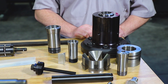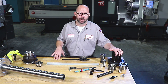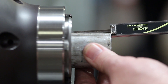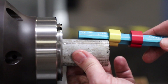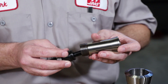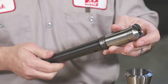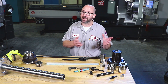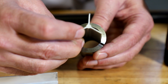Are we stopping our parts against something that is moving or not? We'll start with our part stop of last resort — our calipers. Using calipers for a stop could damage them, so don't do it; there are better ways. Using a stop-lock collet stop works in much the same way but doesn't damage our calipers. We also have collet stops designed to screw into the back of our collets, available for 5C, 16C, and 3J, with extension tubes available for longer parts. But remember, if those collet stops are attached to your collet and your collet is moving back and forth, then your stop is also moving. A really simple, easy-to-use collet stop is this extrusion from Mighty Byte — cut it to length, slide it into your collet, and you have a stop.